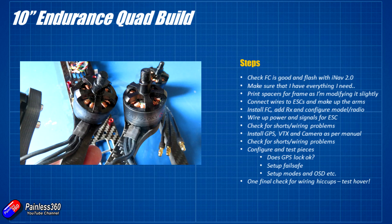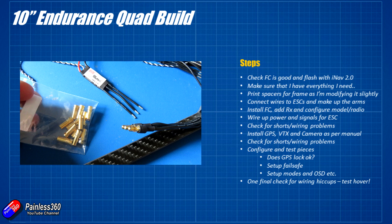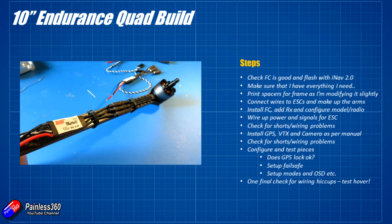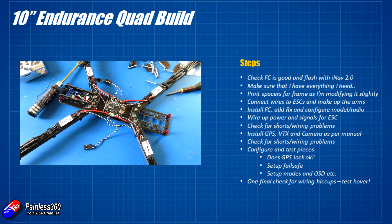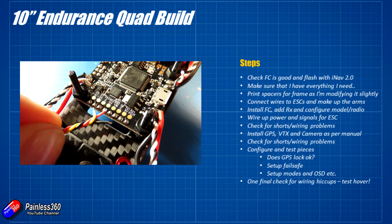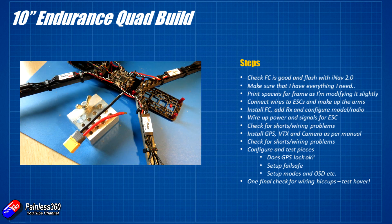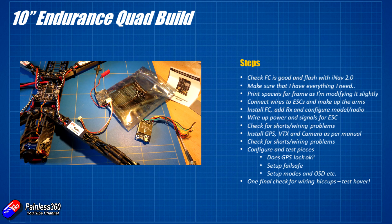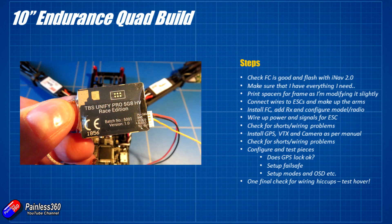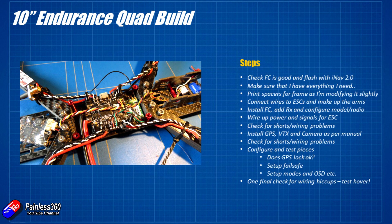The spacers allow me to put reinforcing pieces outside the frame so not only are the arms bolted together, but the top and bottom plates are sandwiching them into position to help with stiffness. Then I put all the power system together, ESCs onto the motors, ESCs onto the flight controller, installed the flight controller and receiver, and did all the wiring for the VTX. I've got a Foxeer camera at the front and a TBS video transmitter at the back. Plugged into iNav, did all the configuration, made sure GPS was powering up, did a quick check on the main power connection for dead shorts with an ohmmeter, then plugged it in. GPS locked, failsafe set, modes set, OSD working.